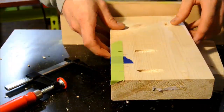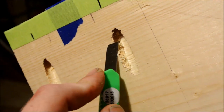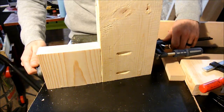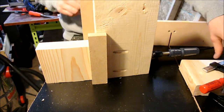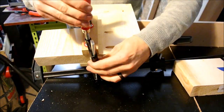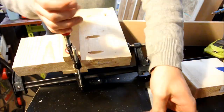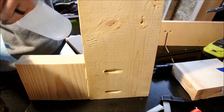If you want to clean up your pocket holes you can use a razor blade to get rid of some of the burrs — it just makes it a little nicer when you're painting. Using some wood glue and clamps I clamped the four and a half inch section to the 10-inch section, used two other clamps with some scrap wood to make sure they're flush, then used the cross clamp to make sure they're tight together and anchored them with two pocket screws. Do this for both sides so you have mirrored images of each other with the pocket screws facing the inside.